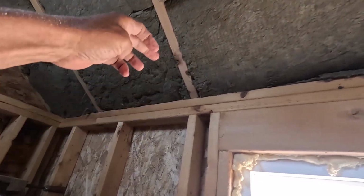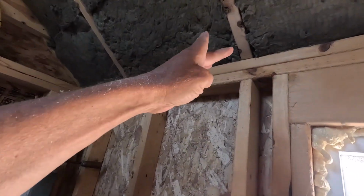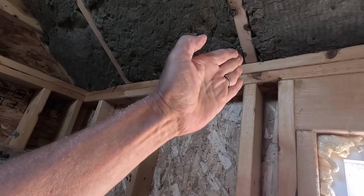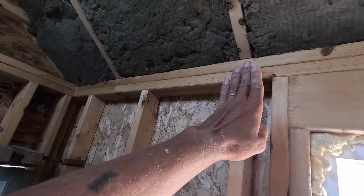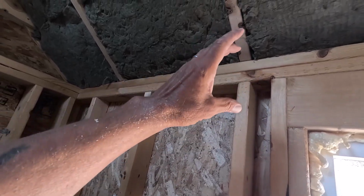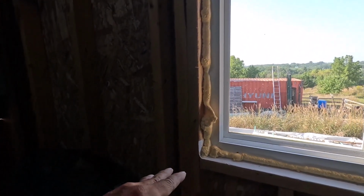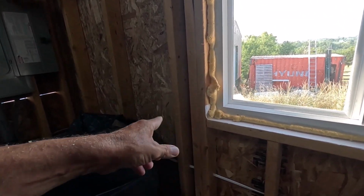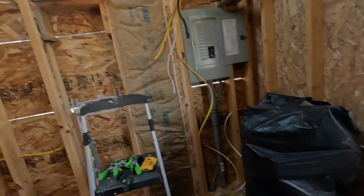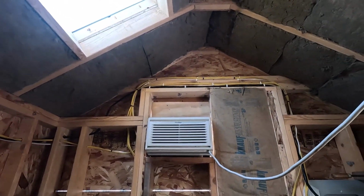Yeah, I got to take out this insulation just to drill. Well, actually, I'll be cutting the outside and placing the pipe right on the inside of the wall and covering it with metal wherever it goes through a stud to keep it away from the cold on the outside. I don't want to be going through the middle of a stud. It might get a little bit too cold there. Yeah, we have some interesting stuff coming up in here.